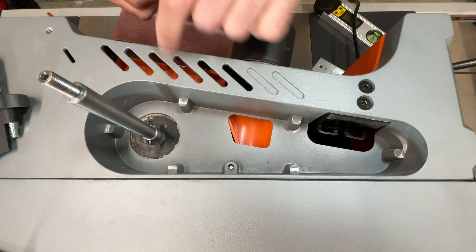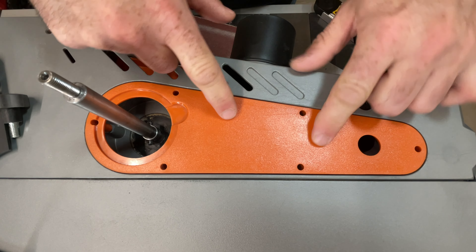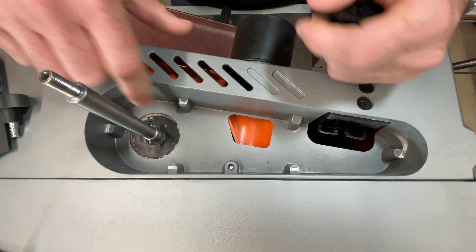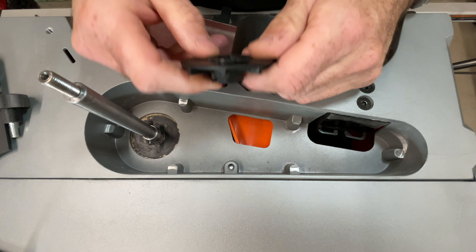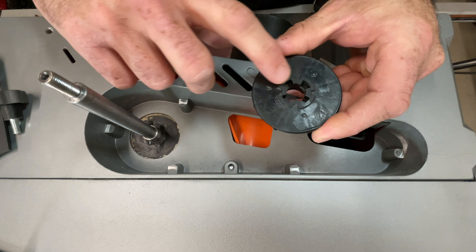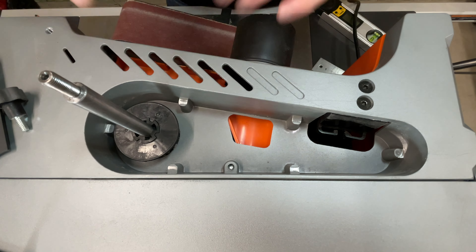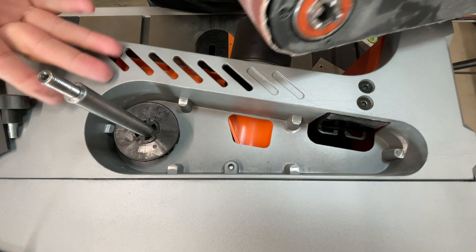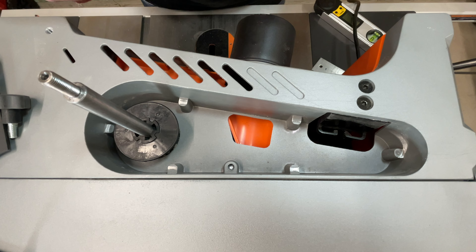Inside, you've got little tabs that are the contact points for your throat plate, along with small threaded Allen screws that let you raise and lower it. You've got the dust port, two and a half inches in the back, with a little slot that works fairly well. The spindle has a little bit of play in it — I don't know if that affects use. A little fan fits on top of the spindle, with roll pins that fit into grooves. The top of the belt drive fits on there via a plastic piece that is effectively the drive shaft for the belt drive system. It connects via four lugs into four spaces. Mine hasn't shown wear after six months to a year, but it's still plastic and it is the main driver for the whole belt drive, so it's something to consider.